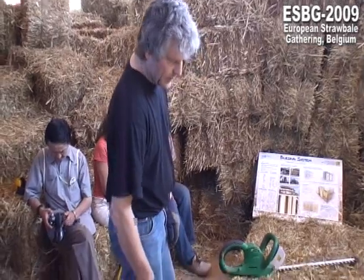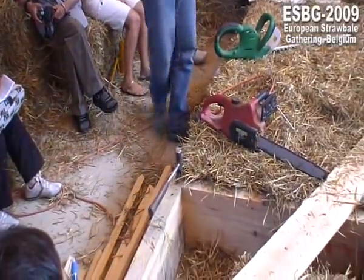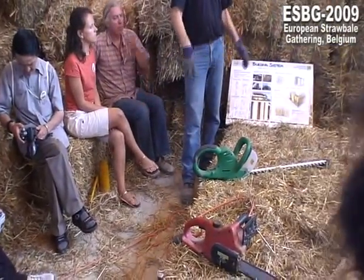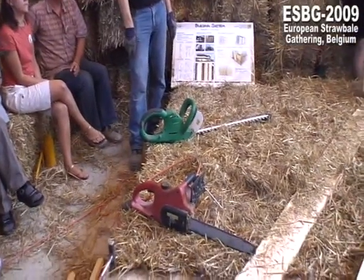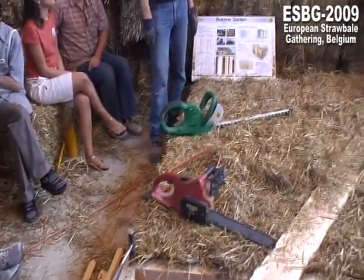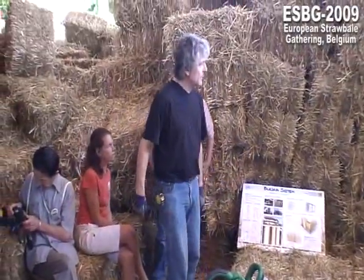Somewhere here, 2.4 meters. And then we put them in and the bales compress by 10%. Really, they're putting in and compression in. The dimensions of the future wall are planned taking the 10% compression of the bales into account. Therefore, we put in this one.